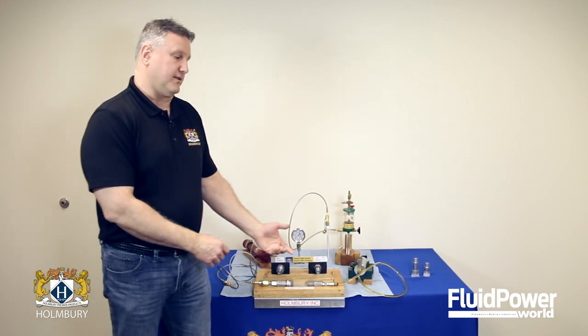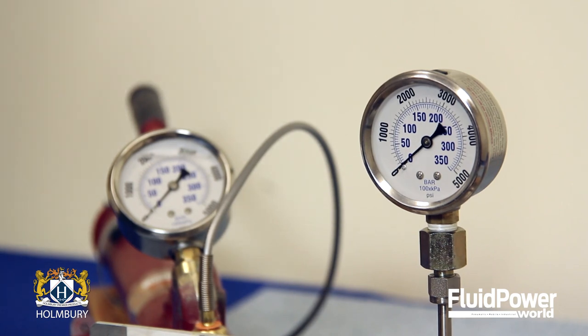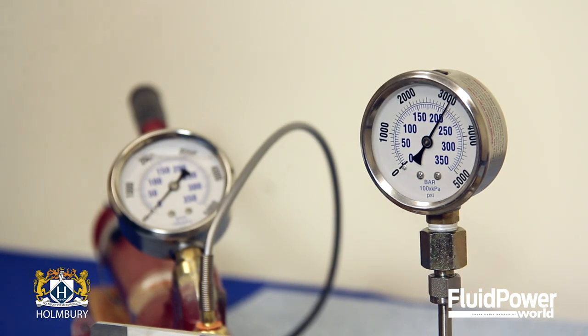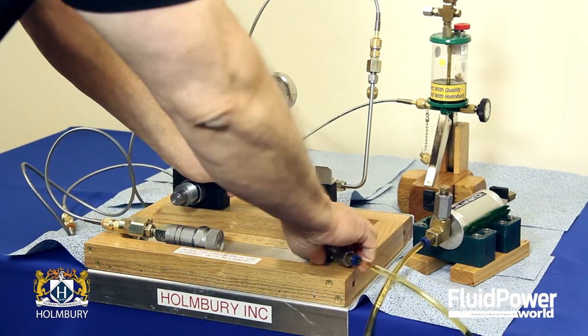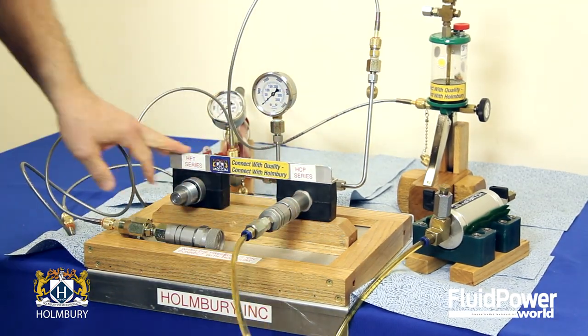In this demonstration, the hand pump acts as the sun, raising the pressure of the trapped fluid in the line to the male coupling to 3,000 psi. The female coupling, which would be mounted on the machine side, is hooked to a line that has dissipated all pressure to tank. In this scenario, the operator can connect the two lines with relative ease.